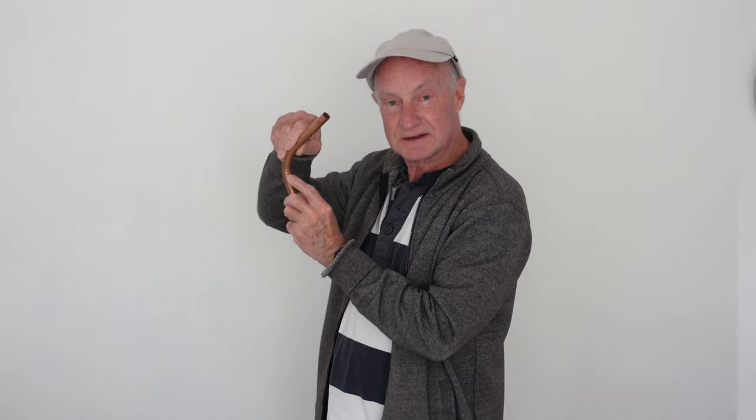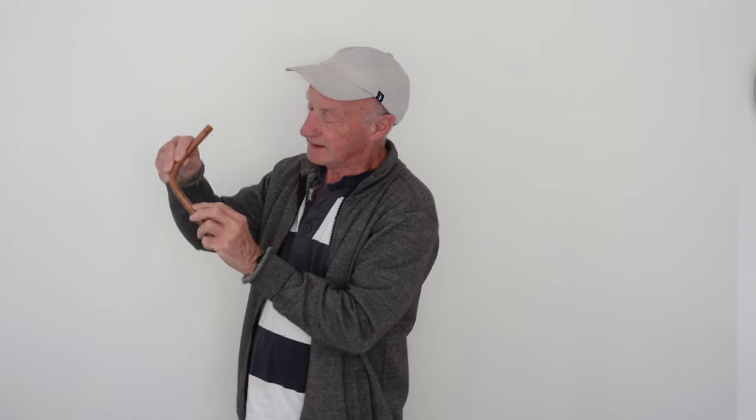So that's a severe limitation - if you've just got a short bit that you're trying to bend, you probably won't get enough leverage on it. I've only managed to get it round to there and there is already a ripple in it here, so not good. If the short piece is all you've got and you're trying to bend it, you won't get it right round - it becomes a little bit too tough. But let's try a set on a longer piece of pipe.